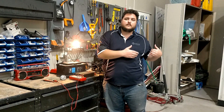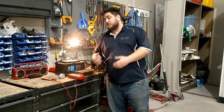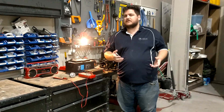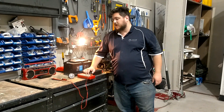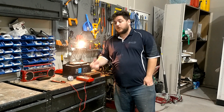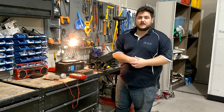It also means that when you want to use your trolling motor for a little bit longer, your engine alternator can put amps back in. It's not a solution for everybody — it's just a relatively cost-effective solution, not thousands and thousands of dollars, more in the hundreds. So this is a 50 amp 12 to 36 volt step-up converter, tested here, and it will be installed shortly on a few boats. If you have any questions, hit us up on Facebook, email, or our website. Thanks for watching — see you later!